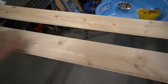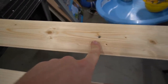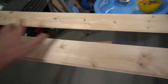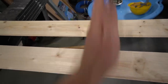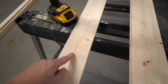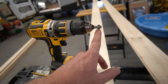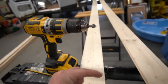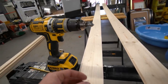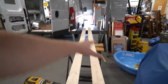So what we've done is line all of the tongue and groove cladding up and use our first template lined up to the ceiling — we've marked all of our screw holes so they should sit pretty bang on in a straight line. Now we're going to pre-drill through each piece to stop the wood from cracking, and then use a countersink drill bit so the screw sits slightly below the surface of the wood. This should be a pretty quick process and then we can get on with staining.